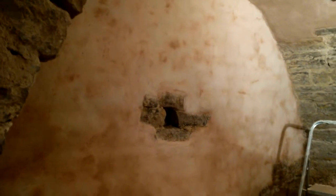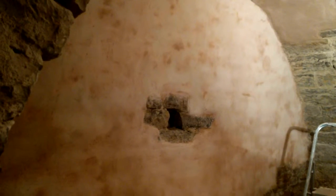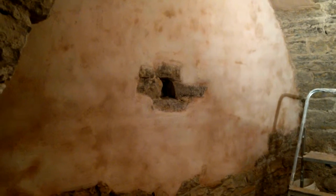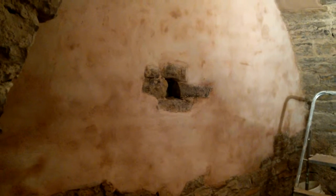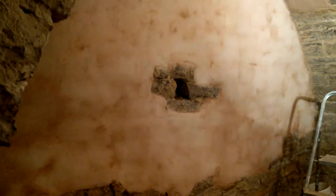If there was old mortar behind that was sucking the water out, it would dry kind of darker. I thought maybe the color might be nice when it's dry but it's not, so I'm going to paint all this. Once it's fully dried out, we'll paint it with fully breathable silicate-based paint that we've used on our clay ceilings in the rest of the house, so that will brighten the place up a little bit.